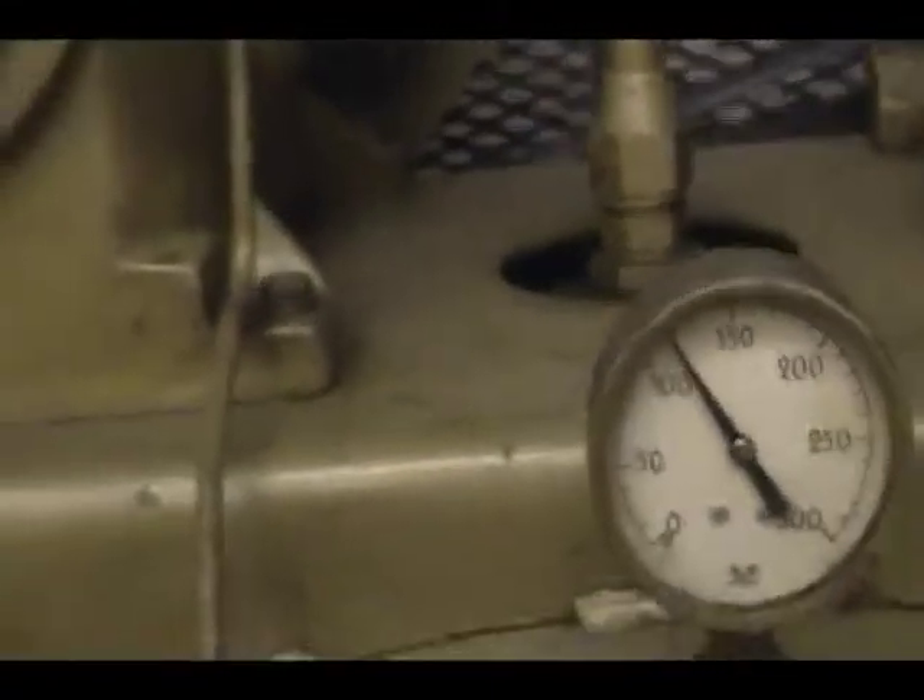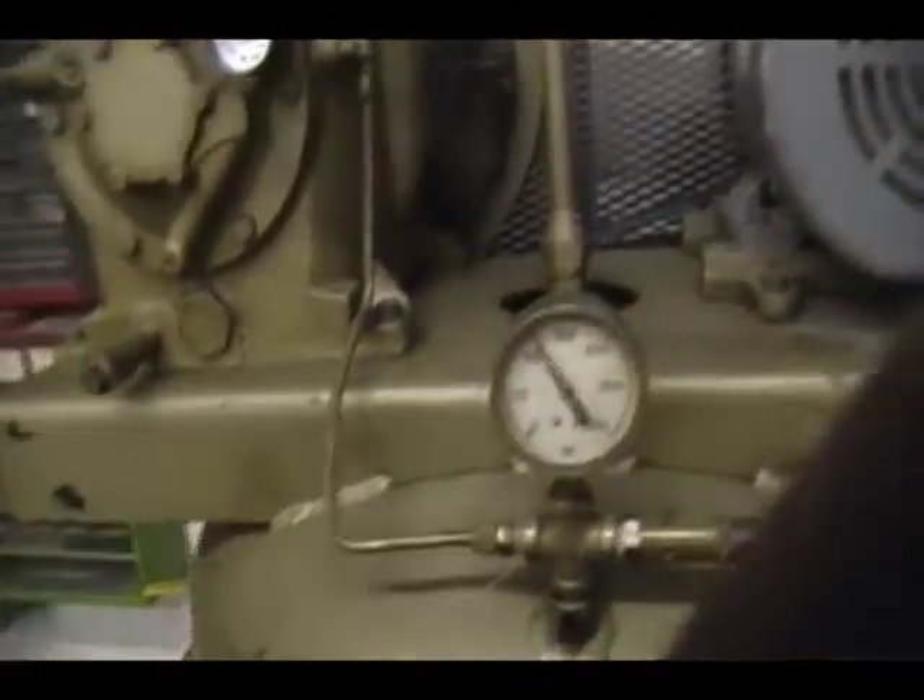Not quite 120 yet. In the next couple of minutes it'll reach its 160-pound high-limit pressure and shut down. Then I'll open the ball valve slowly, let the water separator accumulate from both sides, and slowly open the pressure regulator to see how well my soldering job holds. I'm not a plumber — that'd be my dad — but he's been busy, so I took it upon myself. He's taught me everything I know about plumbing and electrical, so I figured, give it a shot. Worst case, just redo it.